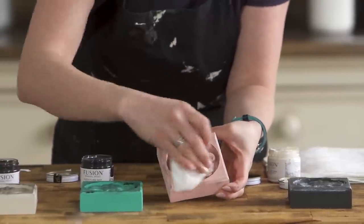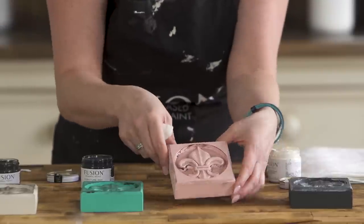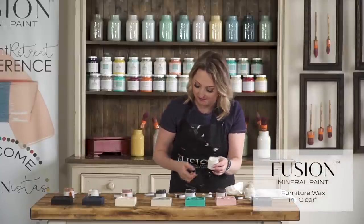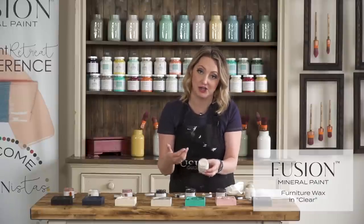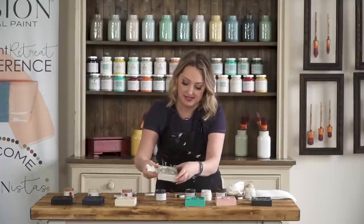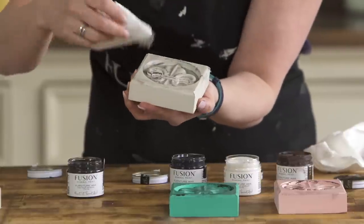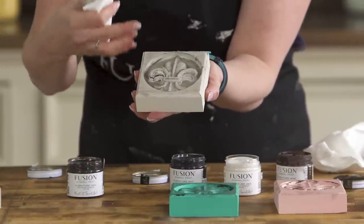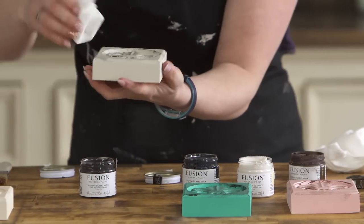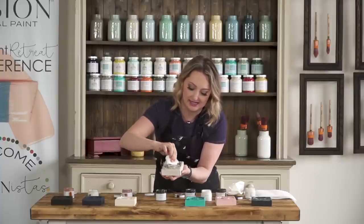You can remove the excess and you get some of the darker areas where it's recessed — the wax has really sat in there. I'm going to show you a little trick: we also have a clear furniture wax. With the clear, it kind of acts as a magic eraser. So if you've put too much wax on something, you can take a cloth — for example, this was our aging over top of Champlain — and if it's still a little bit too dark, just take a little bit of the clear on a cloth and buff it. It actually removes the wax, like a magic eraser.